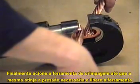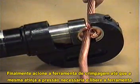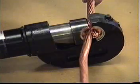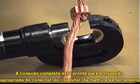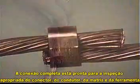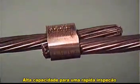Lastly, cycle the crimping tool until the audible pressure release is heard, and release the tool. The completed connection is ready for inspection for proper connector, conductor, die, and tool. More on inspectability in a little while.